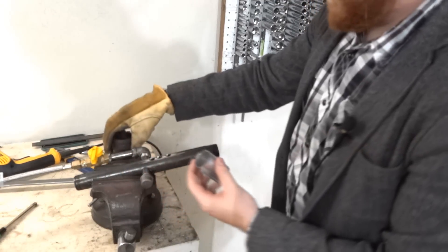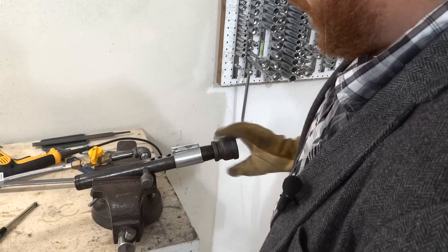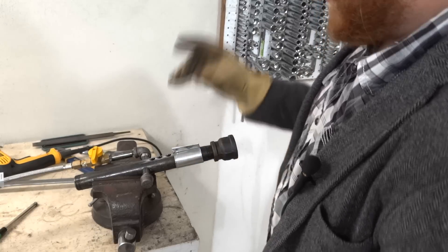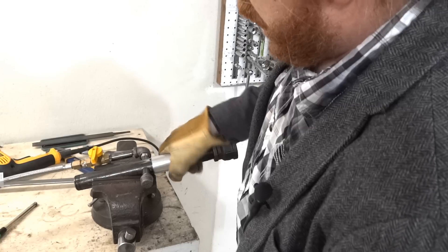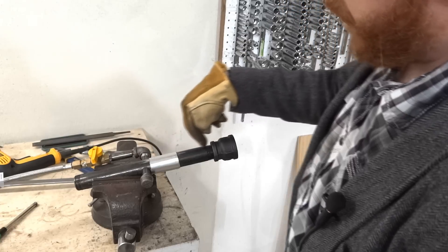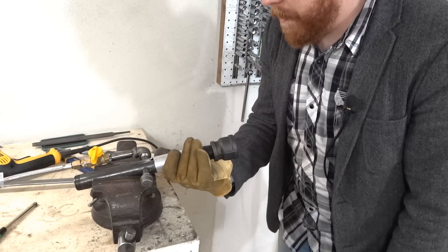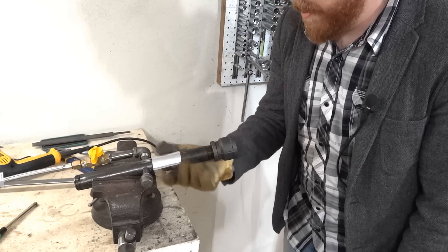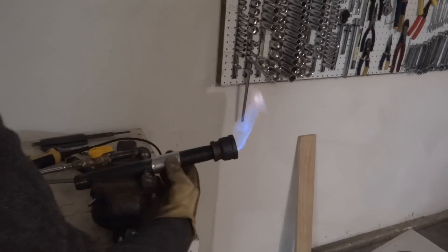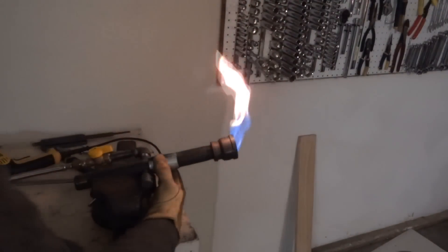This sleeve, cut from a piece of four-inch aluminum dryer vent sheet, could give us a little bit of both — it's very thin and just temporary. If this works I'll make one out of steel; this aluminum one might just melt. The idea is: if I cover up all the holes once I get it lit, there won't be enough air to react with the fuel — it will have to blow the fuel out the end before it starts burning. Then once it's going out here I'll open it up and adjust the ratio. Flames in the end — perfect success!